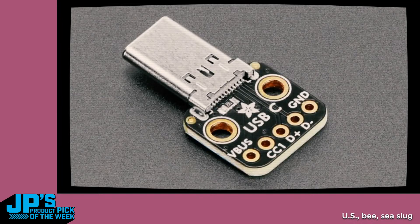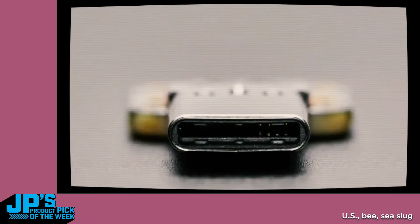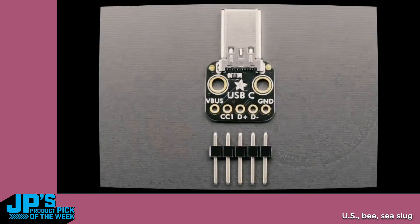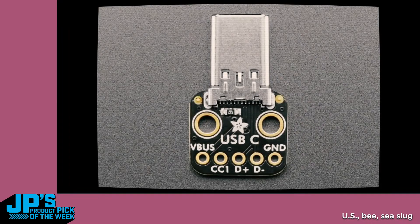The plug side actually only uses one side of the USB-C connection — that's normal. On the USB jack side, it detects which CC pin is connected and knows which direction it's plugged in. It should be symmetric; if it isn't, there's something kind of messed up about your computer. This way it can tell if it's plugged upright or downwards. 99.99% of the time, your computer or host device will connect both together. You can also disconnect the CC1 pin if you want this as a host USB — measure the resistance so you can remove the 5.1K. You can plug it right into USB power delivery and it'll give you five volts, and if you want data pins from a computer or to connect a client device, you're good to go.